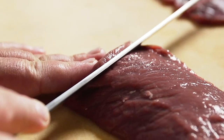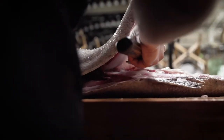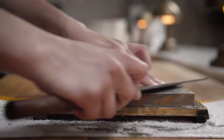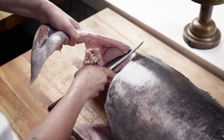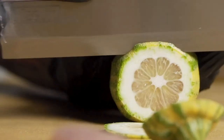Japanese steels are all about high-end performance, though they require a little more maintenance. You're going to get true lasers with Japanese steel because they have much higher Rockwell hardness — anywhere between 61 to 65 HRC for the really hard stuff, and some specialty steels can get even harder. What you lose at that high hardness is resistance to chipping, so any bones you might run into will chip the blade, and then you'll need real skill at a whetstone to fix it.